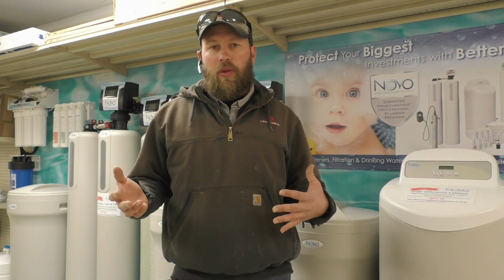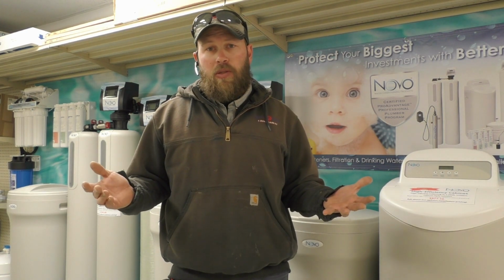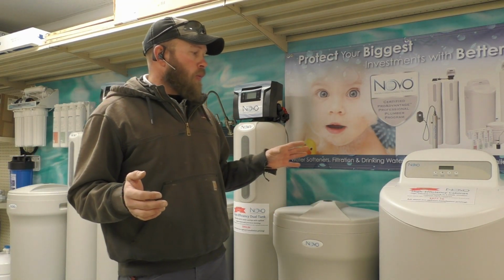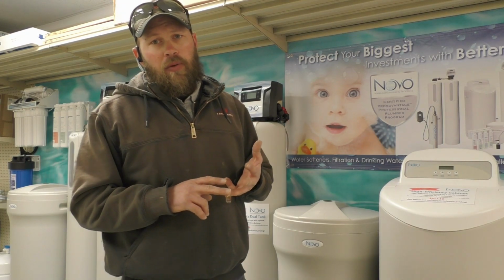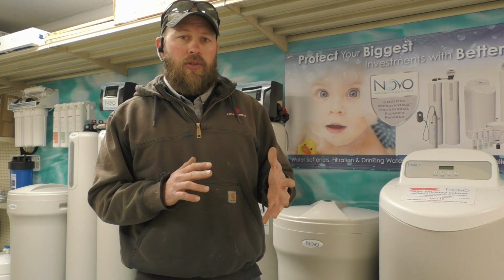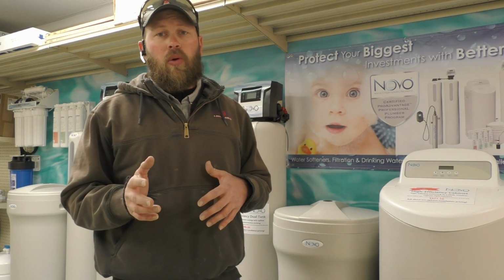The way we start with a house, we're going to first do a water sample. We're going to test your hardness, basic hardness test. Super easy, doesn't take very long. But we're also going to look at the iron levels, the manganese levels, if there's any chlorine in the water. Chlorine affects softeners in different ways, and there are other options on removing chlorines and chloramines.